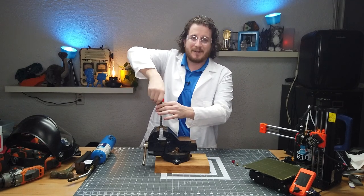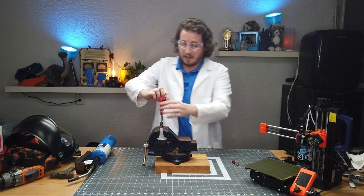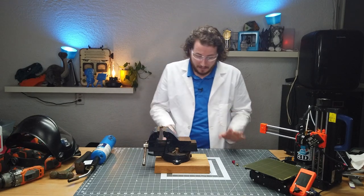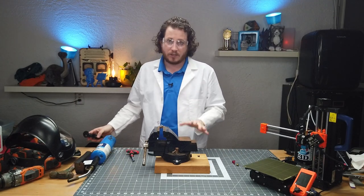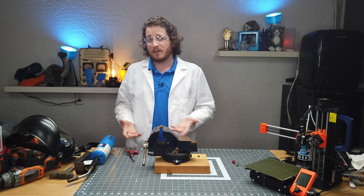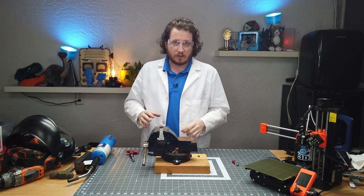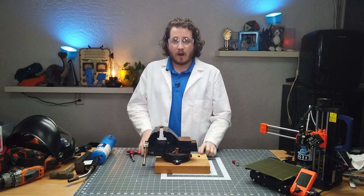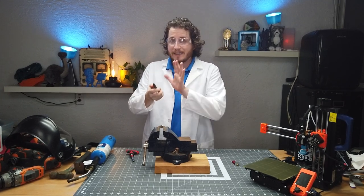I didn't think this was going to work — this is going to be a really simple video. You might get lucky, you might not. I got incredibly lucky. We still had a thread or two still in this thing and were able to pull it out. In the event that the nozzle was completely stripped — which is what I was banking on — you can flip it over, grab a soft piece of metal, a metal wedge, preferably like a nail set that is not hardened if you're using a hardened steel nozzle.